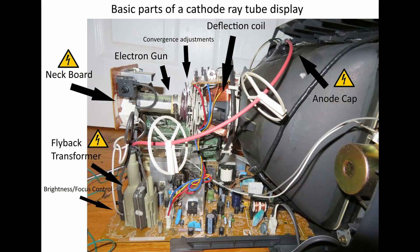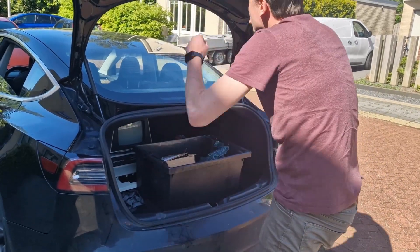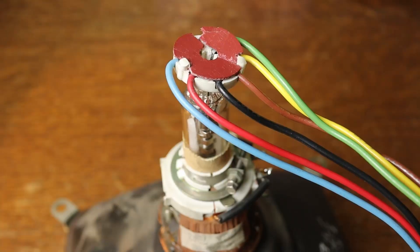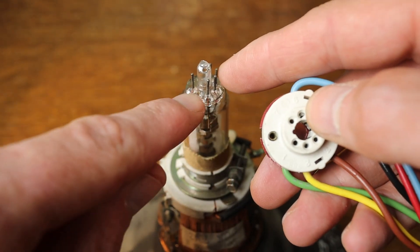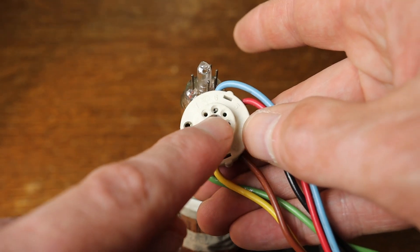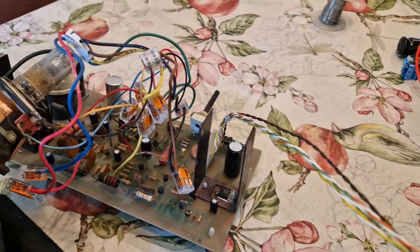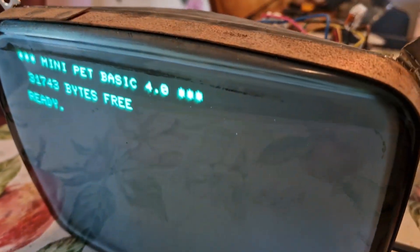I brought the CRT to an electronics repair shop and their conclusion was that the CRT itself was broken beyond repair, so the quest for a new CRT began. Those are very hard to find but I was lucky to find one locally — big shout out to Marvin, well known in the Dutch retro scene, link to his webshop in the description. Since I'd never worked on CRTs before, I asked for help on tweakers.net and one of the people responding was Frank. He replaced all the capacitors on my controller board and disconnected the failing CRT. While disconnecting it, we found that one of the connections on the back of the CRT had broken off and was stuck in the plug — that's why my PET display wasn't working. We took the board from my original PET, took the connector and CRT from the other set, connected it all together, and it worked like a charm. Thank you Frank for your expertise and hospitality.